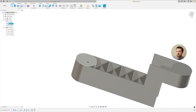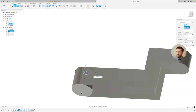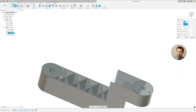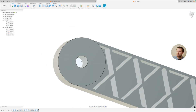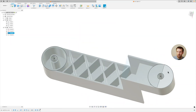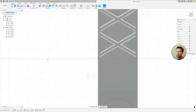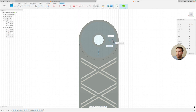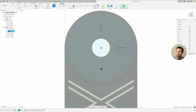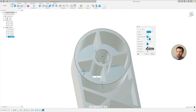Now we need to make some small modifications — adding the holes for this part. I'm going to bring back those sketches, I think it's two and three, and extrude these holes out. They're still not connected — this is an independent body — and there's a reason for that. When I shell these in a second, it'll shell how I want it to. So we're going to shell this again, make it one millimeter, and shell this one as well — one millimeter. Now I need to do the same thing on the bottom section. I'm making the lines in this area — I don't really think you have to do much else beyond just making these lines. I probably could pattern the rib in a circle, which is the more efficient way, but just knocking it out with sketches is efficient enough. Then we'll try the circular pattern on the next one. So again: create Web, select those lines, make it one millimeter.